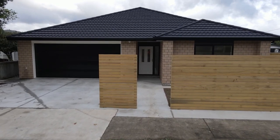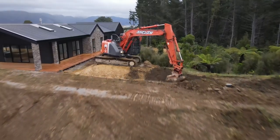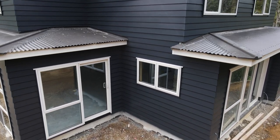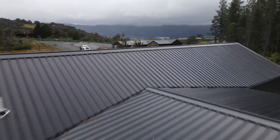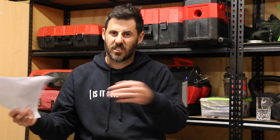Then we do what's called a post-clad or weather tight. This is a reasonably new inspection — in the last five years or so. Technically you need to do a post-clad or weather tight before you apply any coatings to the external cladding system, so they're basically making sure you've installed all of the cladding system correctly. But depending on your council, often we do the weather tight when the house is painted and has all its soffit beads in. Some people prefer that it's painted because technically most cladding products need to be sealed — so it's kind of a conundrum: do you fill all the holes and seal it and show them it's watertight, or not fill the holes and show them it's been nailed off correctly but still needs sealing?